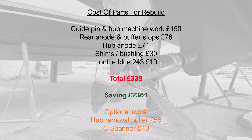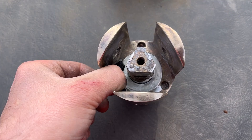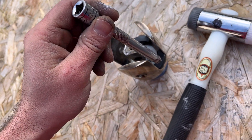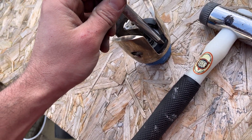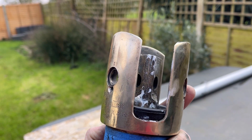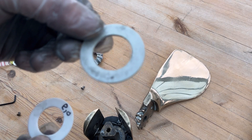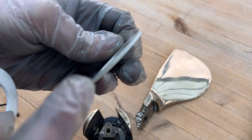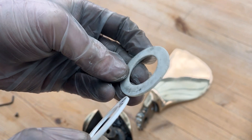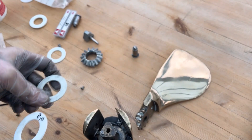You can also buy optional tools, though you might already have them in the bilge — which I discovered after buying them from Celeti Marine, a bit of a waste. I'm popping the blade stops in — these literally just push into that little recess. I bed them in by tapping gently with something smooth to make sure they're properly seated. I also bought a selection of new bushings, going for something ever so slightly thicker, though the difference looks minimal.